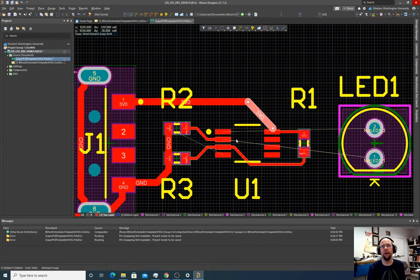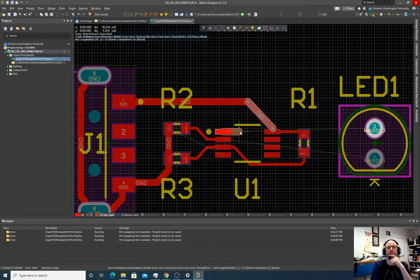There's no way, the way we routed this, to get to these pads through the top layer. Well, we could snake it through here, but it's kind of a mess. We could probably make it happen, but it's kind of a mess. So instead, since we're pinched off here, we're going to use the bottom layer. So as we're routing this, I'm going to just start routing this connection.